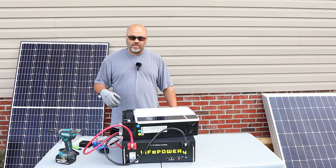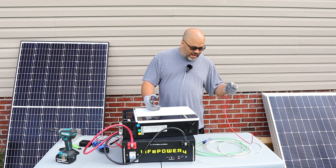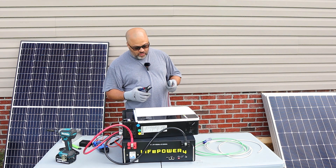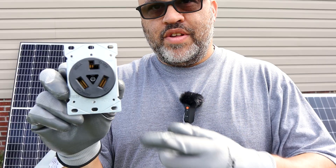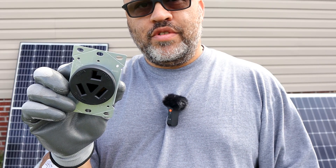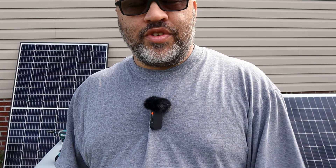All I've got here is red, green, and white wire — just using it for testing purposes. I'll use red and green for L1 and L2. I've got this NEMA 10-30R receptacle; going to hook the wires up to L1 and L2 and see if it works without a ground. I'm not sure if it'll charge the car without a ground, but we're going to try it.